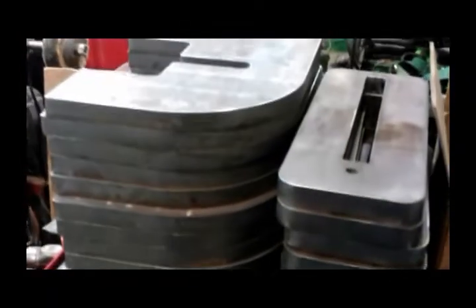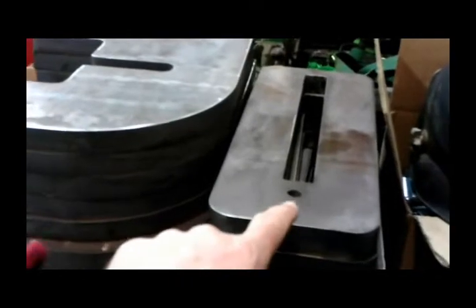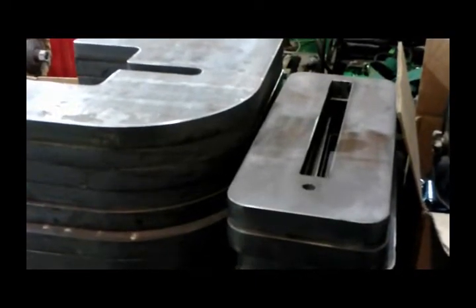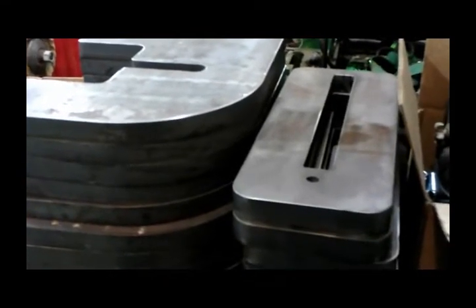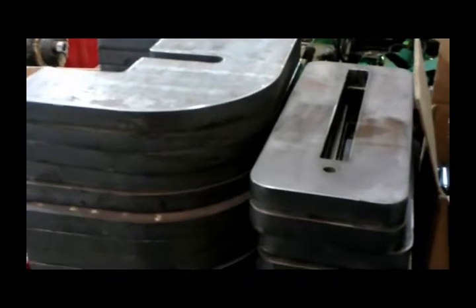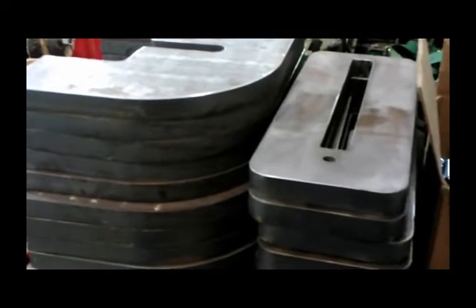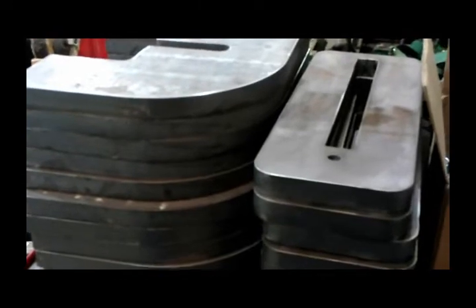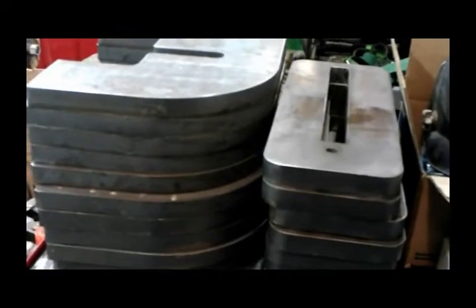There's the stack of all the guillotine tools. I drilled these half-inch holes in here so that's going to be in the center of your lower die — if you get a die stuck, you can tip it over and run a punch up in there and knock it out. I didn't do that on the first one I built, and as I was welding it together that die almost got stuck, but after it cooled off I was able to pull it out.